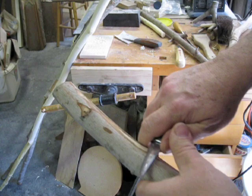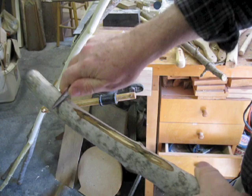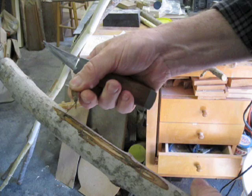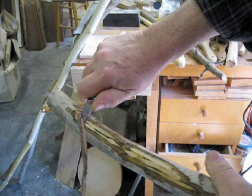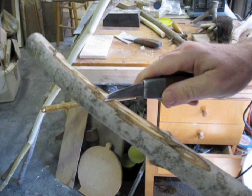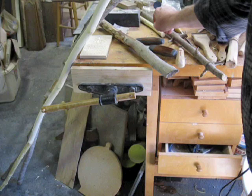Also when you go to clean this, the bark will peel off. If you get it right, you can actually peel quite a long section off. You can see the pith underneath the bark — it's browner, much drier. This whole thing feels drier, sounds drier, doesn't have that cold feel. It's probably not 100% dry, but it's much harder getting the bark off at this point. You don't want something that's completely rotten where the bark just falls right off, because then the wood has begun a decaying process and it won't be sturdy.